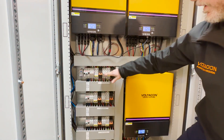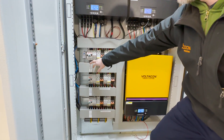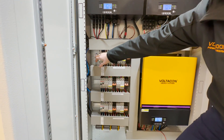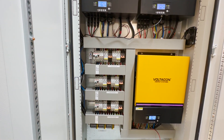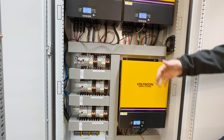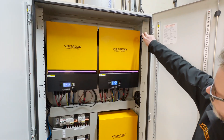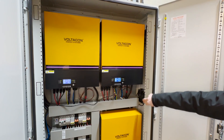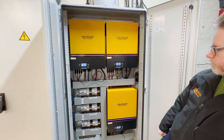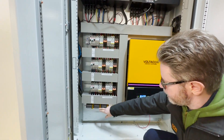That's for inverter one, inverter two, and inverter three — the AC input, AC output, and the MCBs. This is the MCB for our thermistor: when the temperature reaches the preset level, the cooling fans will start. We have two cooling fans from each side — one at the top, one in the middle — and another two cooling fans from the other side of the cabinet.